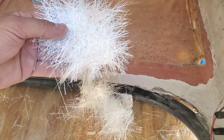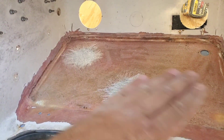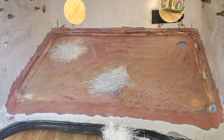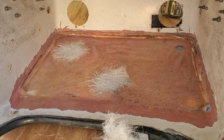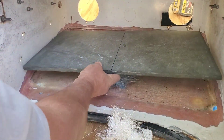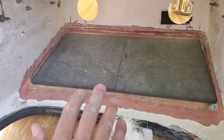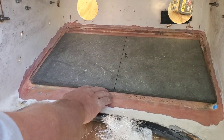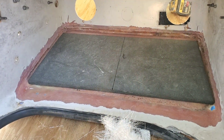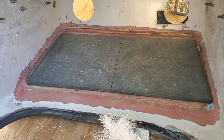This piece is for that hole there. We're going to lay our first layer in, then lay those on top of that first layer, and then we've got our piece of coosa right over here. We're going to lay our piece of coosa in on top after we put our next one in — that's going to be the end of our fiberglass work today. We'll get some ballast set down on it and come back in the morning to lay the next layers.